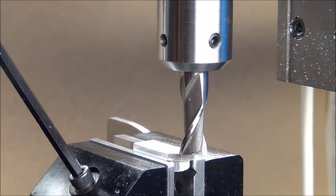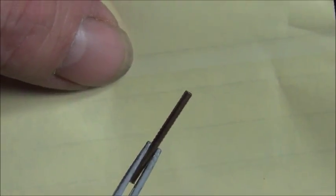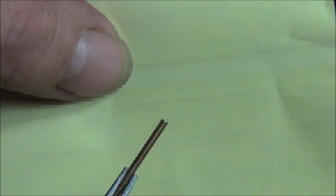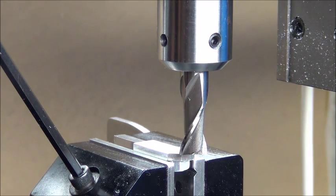So what I did was I took that little 1/16th diameter rod. At first I tried to cut them in the lathe and cut every piece the same length, but that turned out to be too much trouble — the stuff bends easy, it's so small. So basically all I did was cut them off with a razor knife, rolling it on the cutting mat and cutting off pieces of all different lengths, but generally longer than they needed to be. I cut off a bunch of little pieces, put them down in the holes, and put a dab of glue in the bottom of the hole.